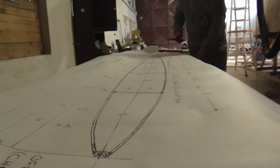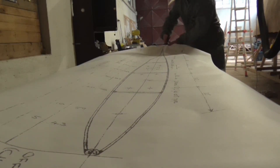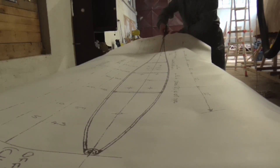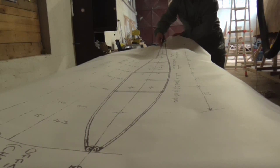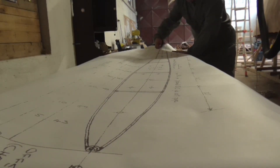This piece has in its upper part a section similar in shape to the section of the ballast keel, while in the final part it has the same section and dimension as the latter. We must therefore try to harmonize the transition between these two sections. The problem is that curved shapes can't simply be traced with a ruler and drawing a square. We have to do it another way.